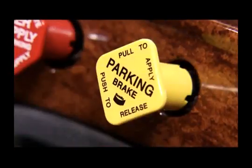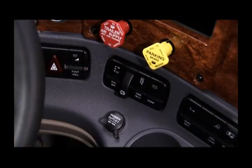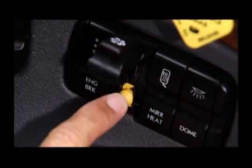You'll want to review your operator's manual carefully to fully understand the regeneration process associated with engines produced after January 1, 2007, but here's a brief overview. When manual regeneration is necessary, the vehicle must be parked and idling with the clutch released and the tractor park brake engaged. Simply flip the safety cover open and hold the regen switch in for 4 seconds.